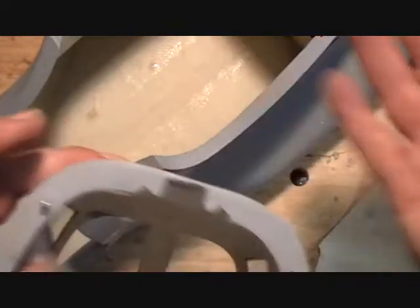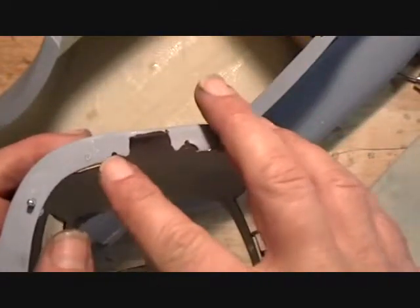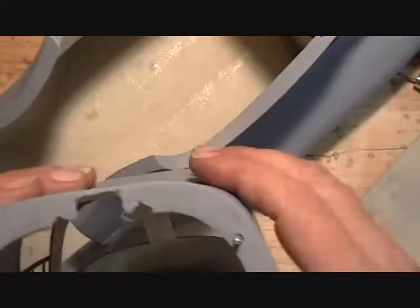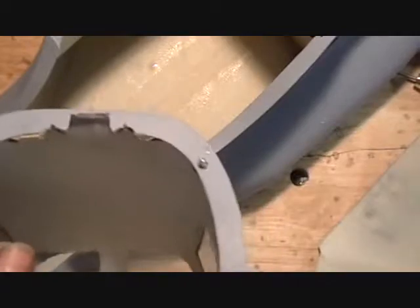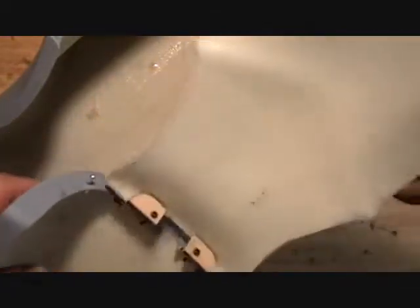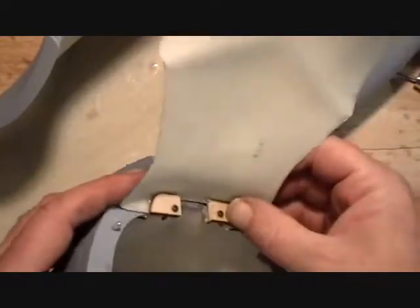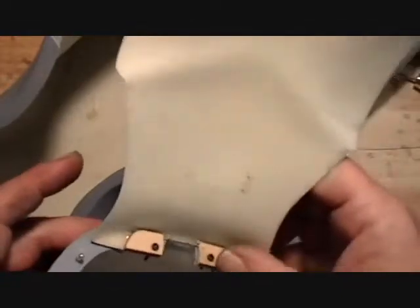This is after you've taken the tape off. Remove this part, and then I take my Dremel drum sander wheel and grind down so I expose that smaller hole, so it's only a half a hole, and then that fits in there perfectly with these screws once I install these two 2 millimeter by 10 millimeter cap screws. Then that fits.